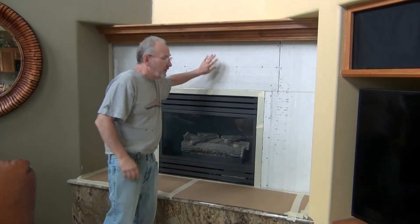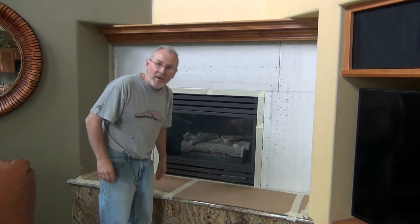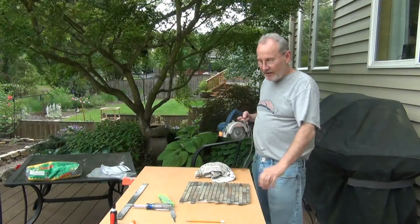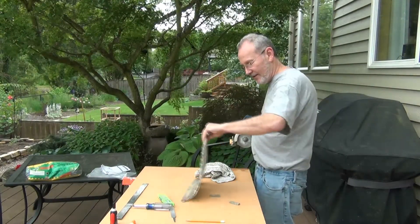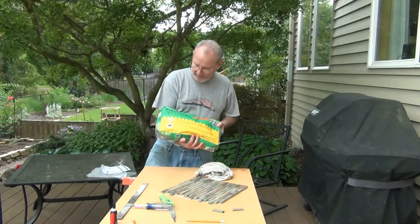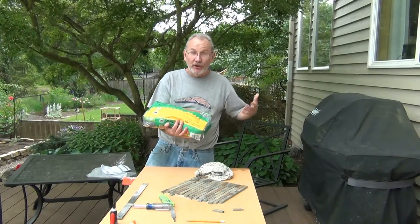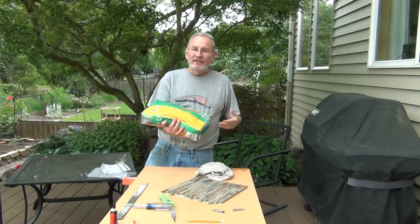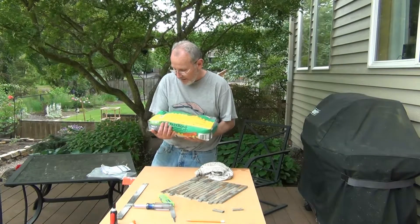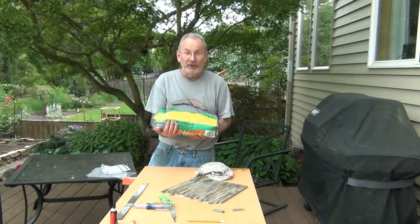Meanwhile, go ahead and check out some of the changes I've made to the fireplace since last time. Happy homebrew everyone! It's time to start finishing up the fireplace. We've got our cement board back here, and under here we've got our granite - same stuff we've got in the kitchen, left over from years ago. I've got my tile cutter here and I've cut my first edges down here. Now it's time to mix up mortar. We're using flex bond right here - a little bit higher end stuff. You can't use the pre-made stuff around a fireplace because there's a lot of glue in those and when you turn on your fireplace you're going to be smelling it. This has some polymer additives so it's got superior bonding capability and it shouldn't give me any odors.